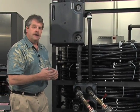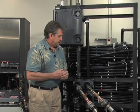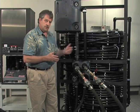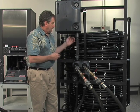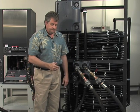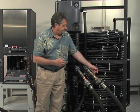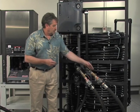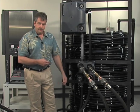When I open up this ball valve and the return ball valve, we're going to be using the municipal water source. It's going to enter the loop over here, go through our five 300-foot training lab circuits behind me, go straight through our GeoPrime tank, come back down through our flow controller and begin to fill our reservoir. Now the water is entering here, going through our loop, coming back through the flow controller and the pump.